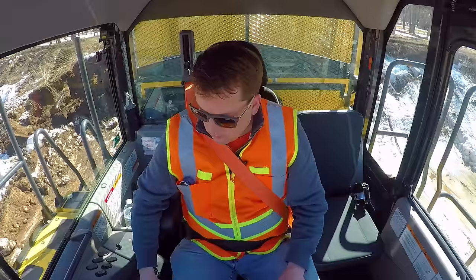I'll park it right here — put it in neutral, and always make sure the parking brake is on to keep the machine from rolling. Let it cool down for about 30 seconds, then shut it off. Three points of contact getting out. That's our Komatsu off-road haul truck — hope you enjoyed this. By no means are we experts; you definitely want to check the manual. I'd also be interested in hearing your comments and feedback, so please comment below if you run one of these full time — you might have some good tips or suggestions. Thanks a lot for tuning in.